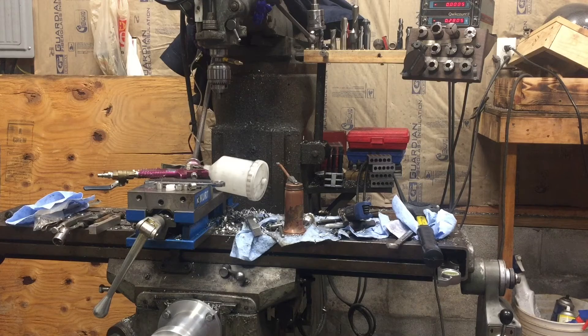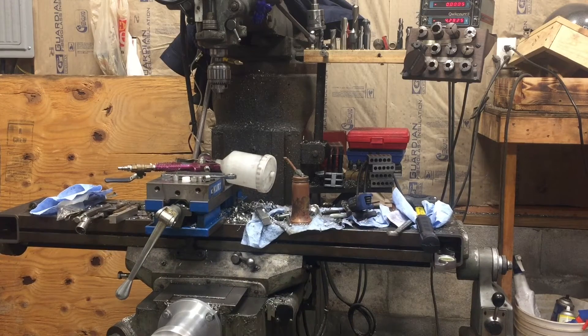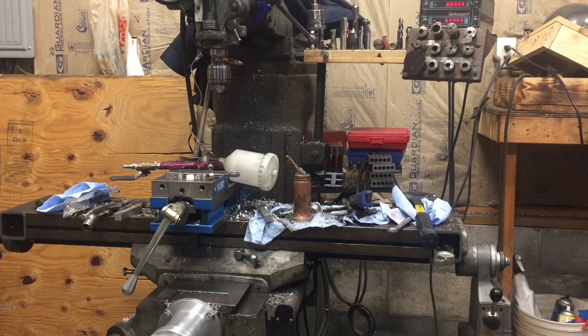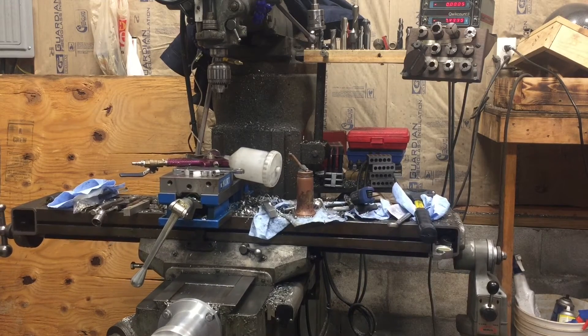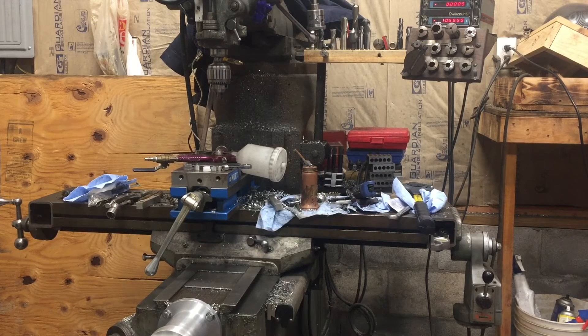Very responsive at that 10,000 RPM per second rate. So we'll slow it down to 1,000 — we'll jog the other direction. You can see it takes a little longer; it coasts, starts, stops. Here's 100 RPM per second of ramp time. It takes a little while to get going but still reaches speed. You've got to watch that setting — it'll coast a long way on you. I had the servo maxed out there trying to get to a position it couldn't achieve.